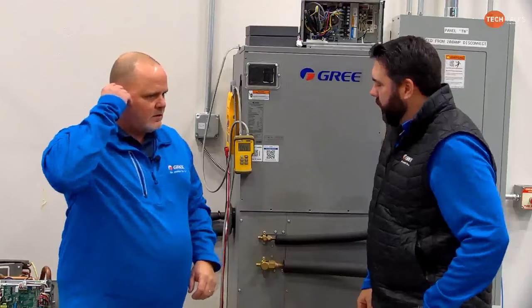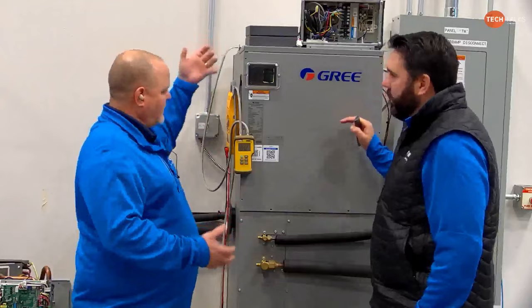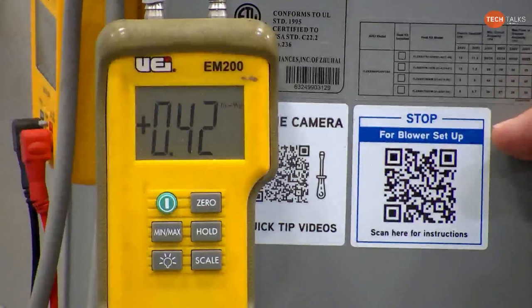We're not really able, you don't have a full pressurized duct system, so even what we're doing here is really not real world, but anyway. Still, it gives you an idea. You close it off some, static pressures went up a little bit. So we want to take that static pressure, look at our blower chart, look at the fan speed settings and what we should be getting. Target 325 to 350 CFM per ton, and then set the dip switches for that blower speed.